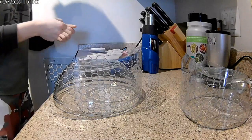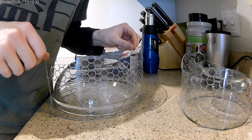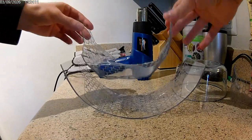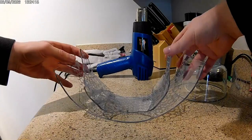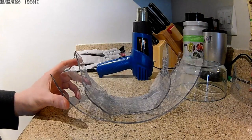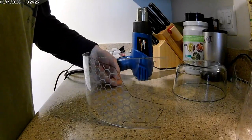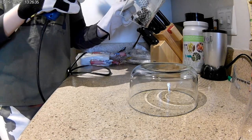It is definitely going to be hot once you're done working it, so make sure to give it a few moments to cool down before handling it with your bare hands. I have my previous visor here for reference, and you can see there's still a big difference in profiles. The next step is to take a smaller die and work the piece the same way as before — this is a very iterative process, just trying to get this flat piece of plastic down to the profile you need to fit in the helmet.